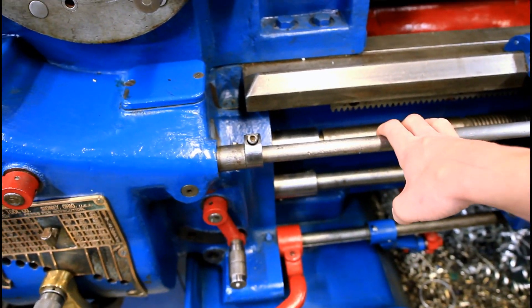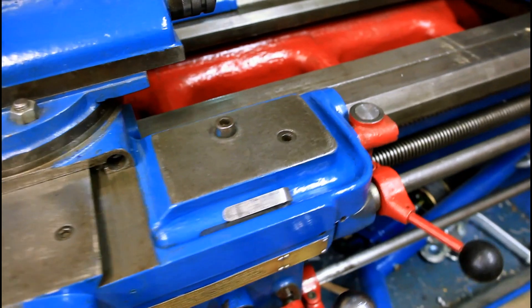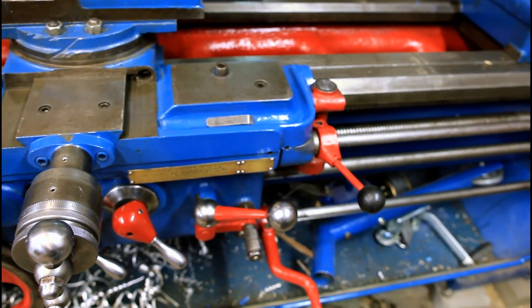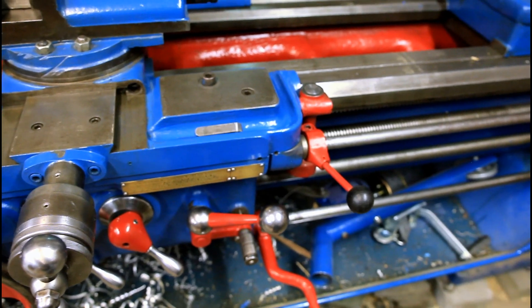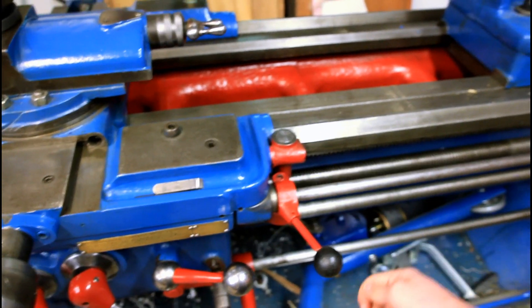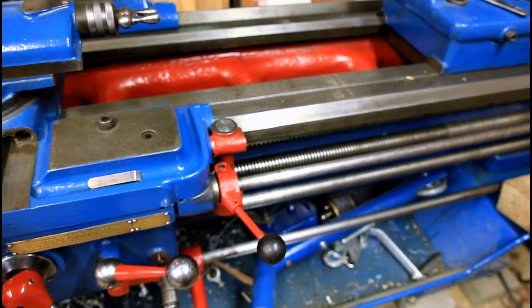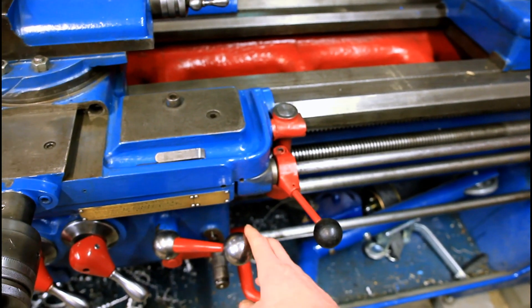It's also got this rod, which is a bit of an unusual feature — it's actually a lead screw reverse powered by this handle right here. What that allows you to do is reverse the thread direction while keeping it in time. So you can pop this lever back and forth and move the carriage along without losing the thread timing. That's an alternate way to cut threads instead of using half nuts.